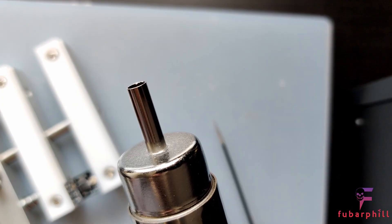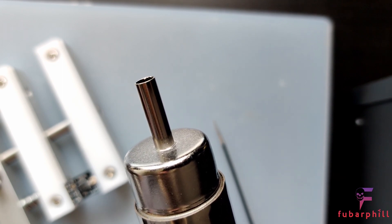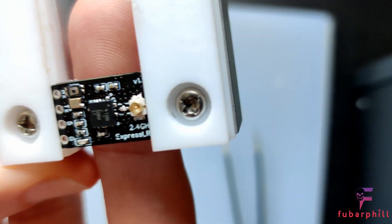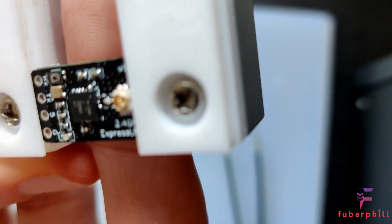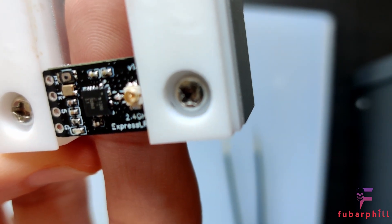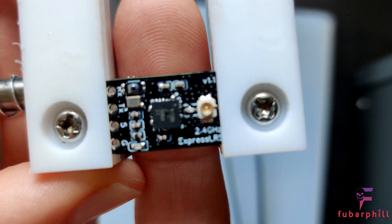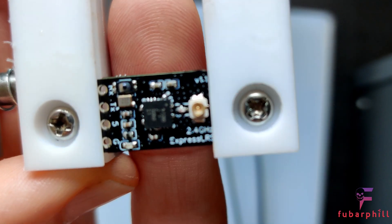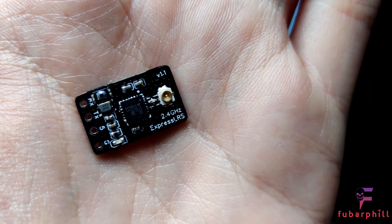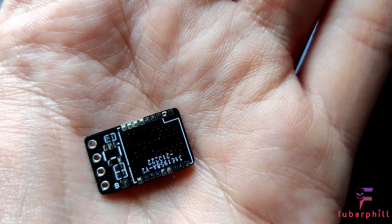Time for some hot air. I'm going to start with a low blower speed because I don't want to blow any of the components off the board. I'm going to do the hot air off camera and I'll be back once completed. Hot air completed — everything's down. I've got a couple of solder bridges. The ones on the right hand side are not a problem because they're basically just ground pins next to each other. The top, left, and bottom do need some tidying up, and there's a blob on the crystal — again, not necessarily a problem as it's not shorting with anything. I'll get the soldering iron out with some flux. And there we have a completed top side — tidied it up and gave it a clean with isopropyl alcohol.